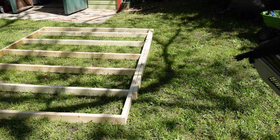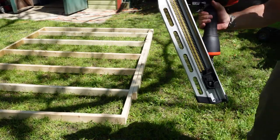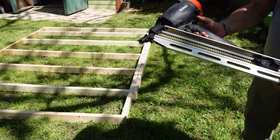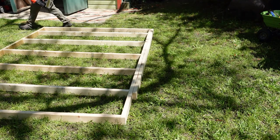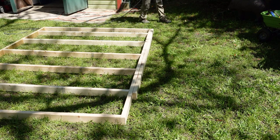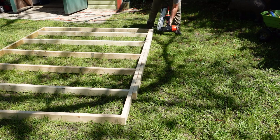All right, we're gonna nail this top plate on here. Again, we're running that simple. As you can see here in the daylight, this is that simple frame gun, and it takes 2 inch to 3.5 inch nails, and just works like a champ. We're gonna grab our air hose. Again, always wear eye protection. We're going to fire this on, and we're going to just tap this right into this. I'm going to put it on, here's single shot mode.